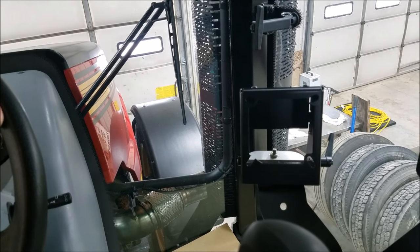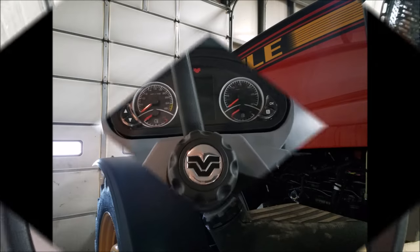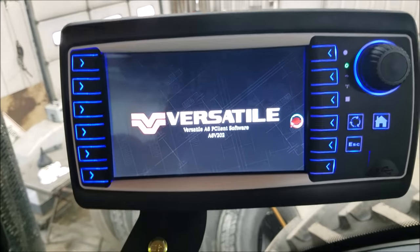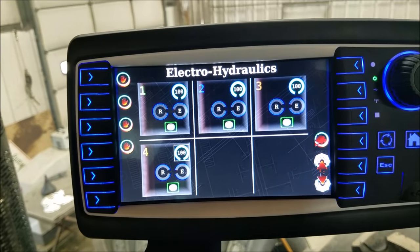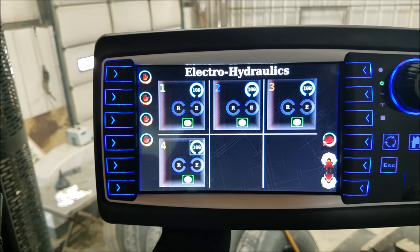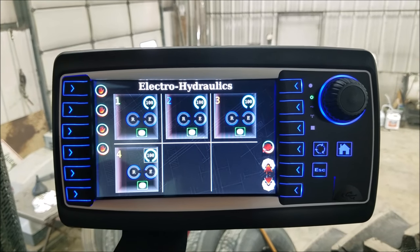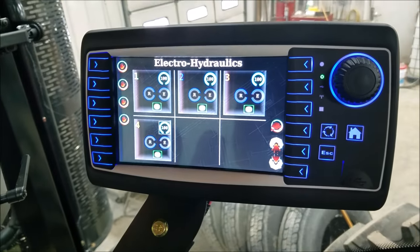We will put our FM1000 right here to complete the auto-steer. This tractor did come auto-steer ready, so it's ready to go. When you start everything up and hit the hydraulic control button, you get to this screen. We have four remotes, and basically all your controls to control flow rates and anything with your hydraulics is controlled right there. Mike Less did do a video on this – I'll put a link in the description – on how that hydraulic screen works. Then you can just turn it right back off.